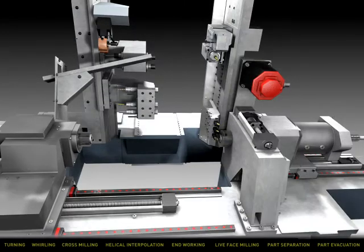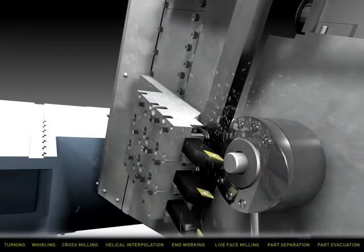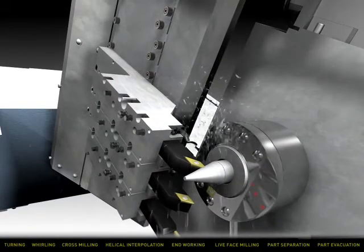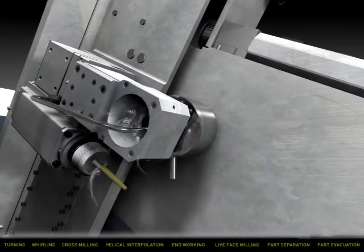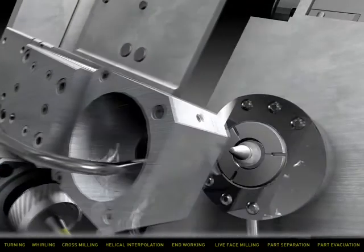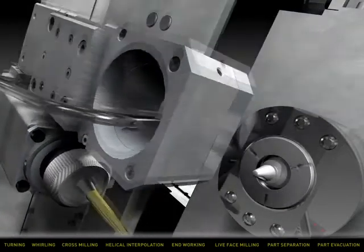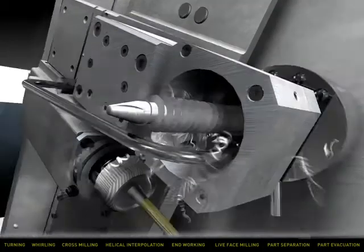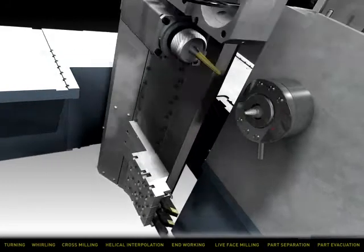Let's take a look at a complete machining cycle. Here, a complex medical screw is cut in 9 steps. First, we approach the part and machine the starting profile of the thread. Then, the thread whirling attachment is used to cut the first 4-5 leads of the thread, preparing it for milling. The main spindle stops and the C-axis rotates to its zero position. An end mill machines the self-tapping flutes. The whirling tool re-whirls the first threads to deburr the flutes, then continues to machine the rest of the threads.